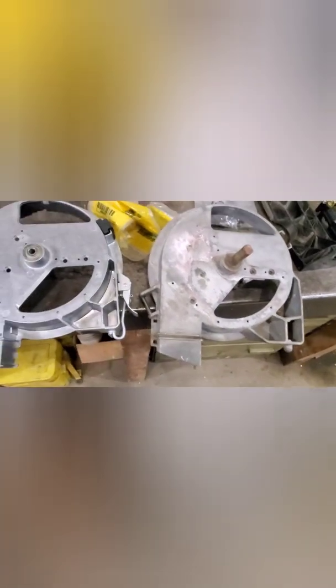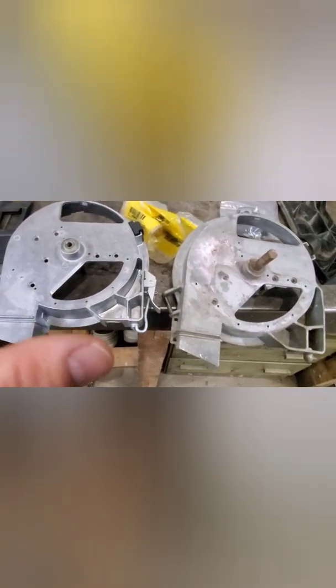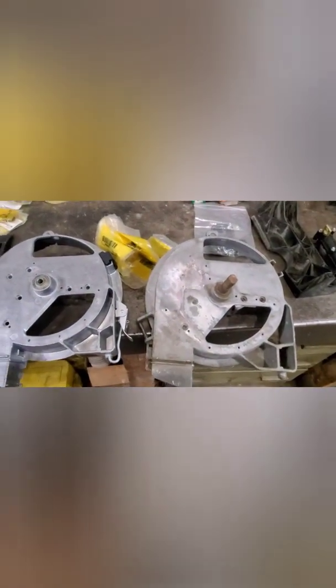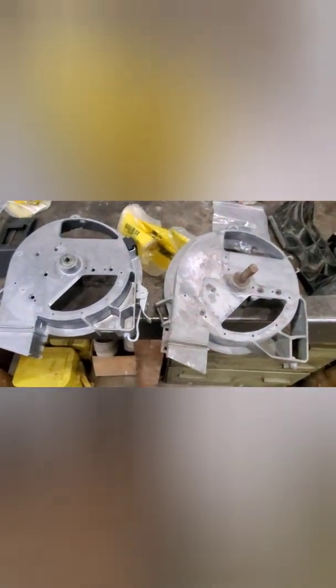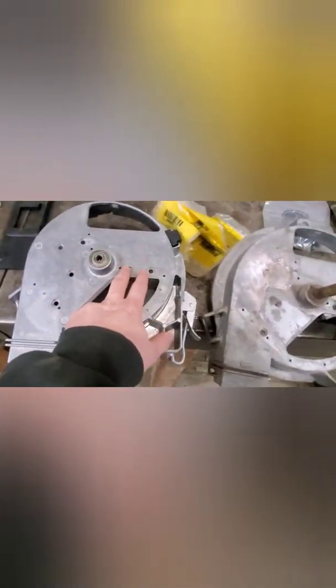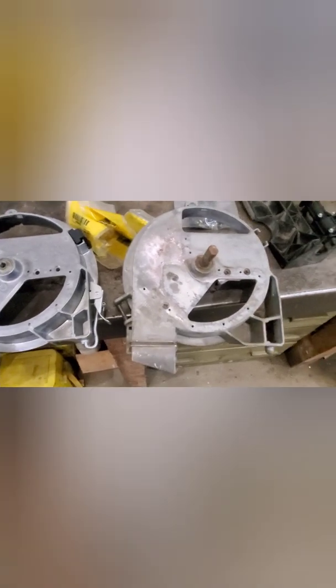If anybody has any questions, throw them in the comments below. Hopefully this gives some people an overview because when we bought a 1790 planter I had no clue there were that many variances throughout the meters and serial numbers. We found out the hard way. If I were shopping for a 1790 knowing what I know now, I would look for about a 2011 model — it would have the factory integrated worm gear shutoff, the double eliminator, the later housing with the Pro Max 40 disc, and it's a significantly improved planter. Thanks for watching — see you in the next video.